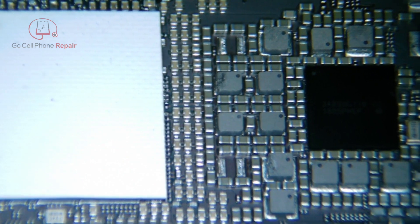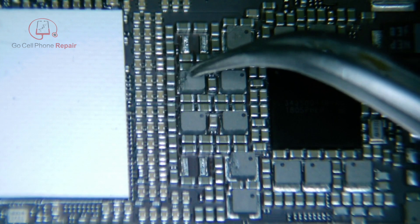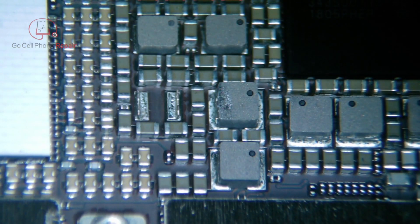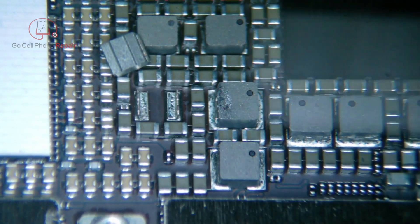If you take a look over here, you'll see that it's not just the backlight circuit that was damaged. We're also missing a couple of components right here close to the processor. And there's actually a third one that fell off later on — that one I'm pointing at right now. So there's been some impact or shock going on here that caused these to just pop right off the board. We'll come back and see if we can find something close as a match. I don't have the specs on those two components, so we don't know exactly what they're supposed to be. And here's just a shot of this thing — it literally fell out of the tablet when I tipped it sideways, so it wasn't even connected on the board.